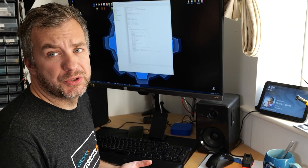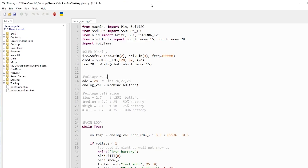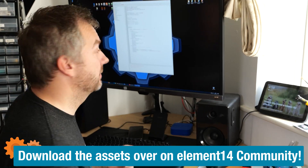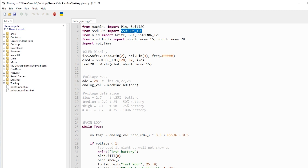To program the Raspberry Pi Pico, I'm using Thonny — let's get started. You're going to need a couple of libraries and you can add those in Tools and Manage Plugins. Just type the name of the library and you'll be able to add it. Don't worry, I'm going to include those in the description. Once they are loaded, they are libraries responsible for handling the I2C display and a couple of fonts so I could have control over the size of the font.